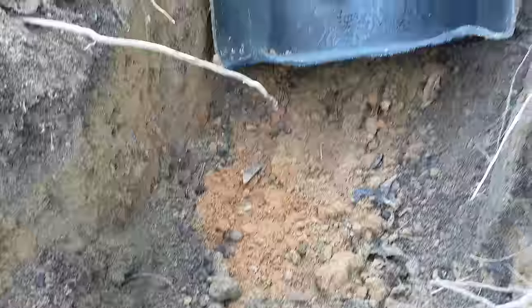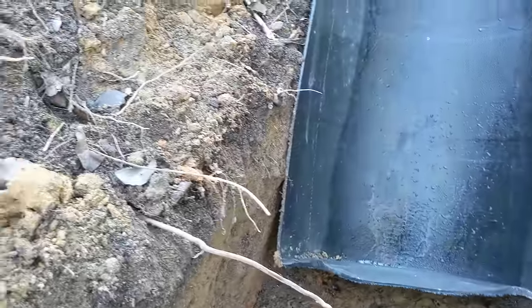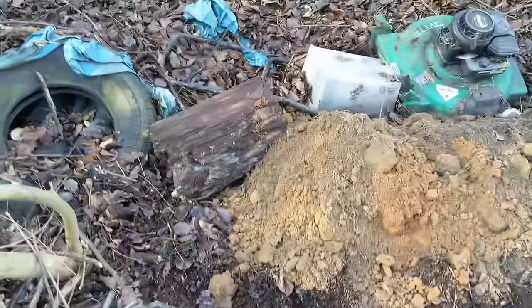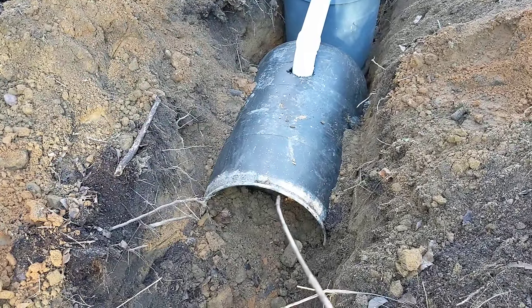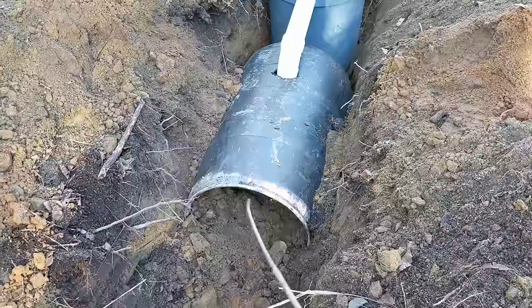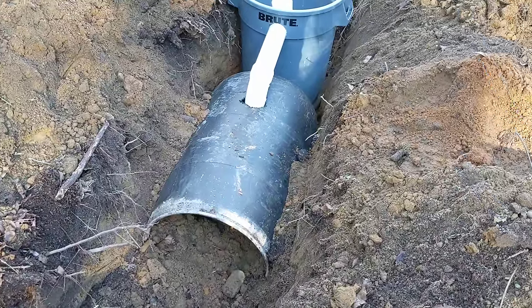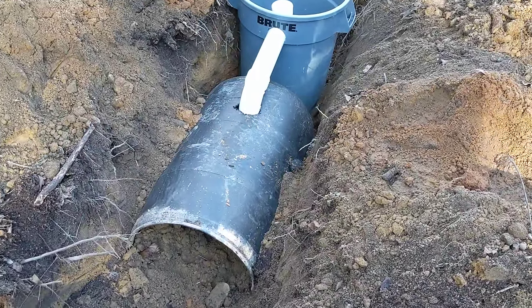Soaks into the ground. Now, I've seen some people put holes in the side so they can help soak in, but I wouldn't do that. These things aren't very tall, so really no need in doing that. Anyway, I hope I covered everything. See it? That'll all fill up with water and be like a holding tank that slowly goes into the soil. And of course the sun evaporates some of it. So if you can do it in a sunny spot, you're better off.